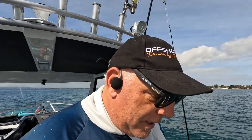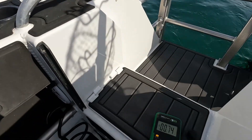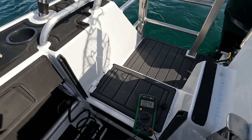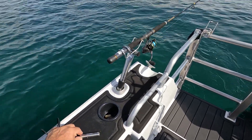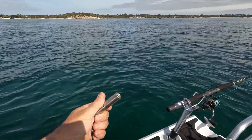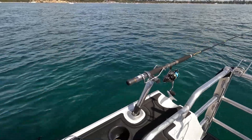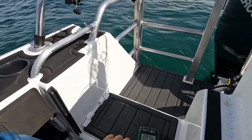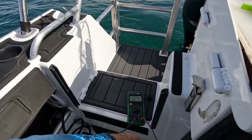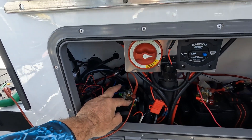The only thing you need is a multimeter, which we have here. You set it on DC low voltage at under 20 volts, and a silver-silver chloride probe. You connect that probe to the common ground of the multimeter on DC, and the positive lead goes into the battery negative.